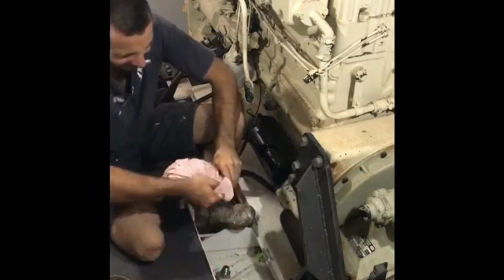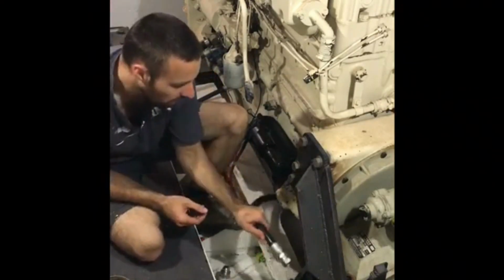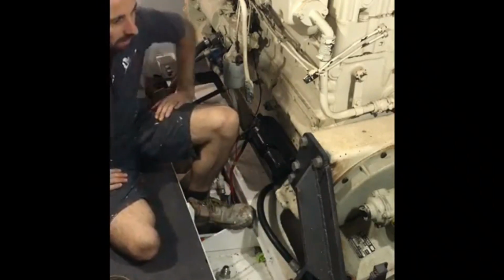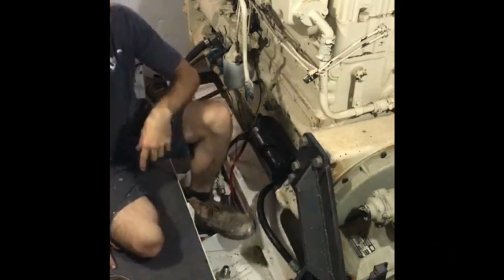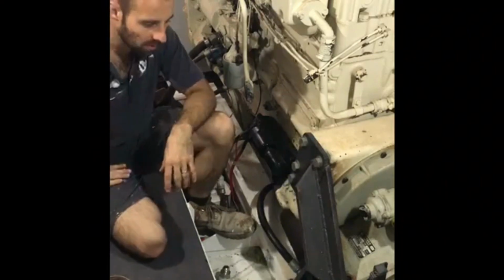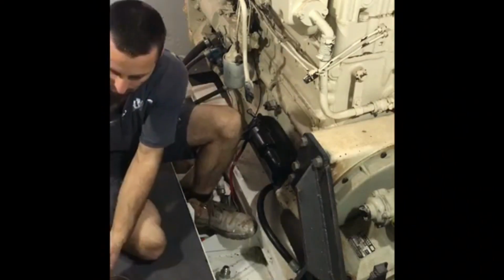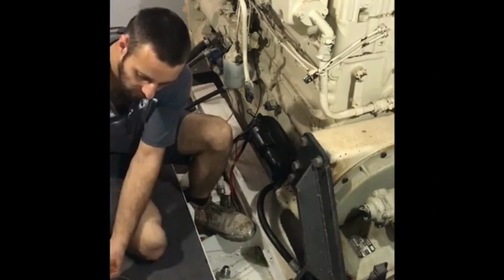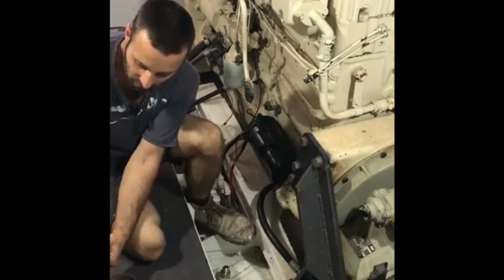So, as in previous videos, I went to get the gearbox and the engine all lined up the other day, and I was a dickhead and didn't get a spigot machined onto my little plate. We thought we could modify the plate, weld it up, build it up and machine in a spigot, but it looks like that's not going to happen. Because, it's a long story, the plate itself isn't square, so isn't true. If I leave that in, it's going to vibrate like a mofo.